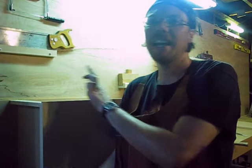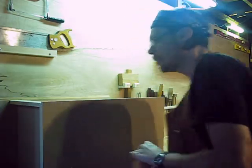Don't want to over nail these because actually the glue is going to hold them in, especially with that long strip up against the shelf. The other thing is you want to hold them back just a little bit from the back panel, maybe like a 1/64 of an inch, so that the finished part is nice and flush up against the back panel. And these are just close.